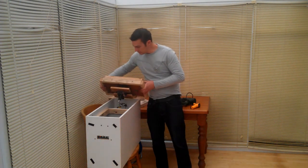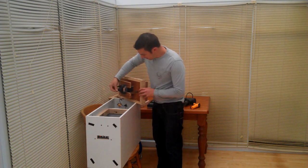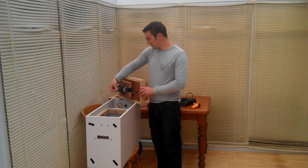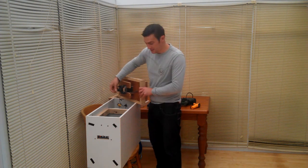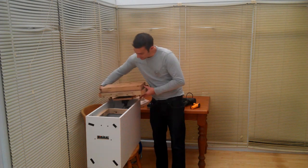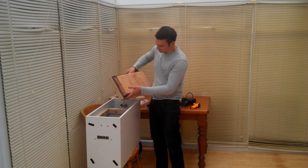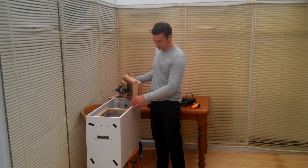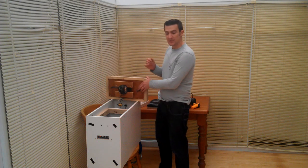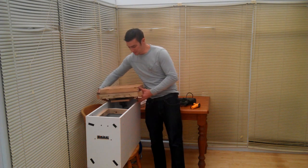My vacuum table itself is all timber construction. This is a vacuum pump out of a Dyson hoover — someone had a damaged Dyson, so I pilfered it, ripped it apart and took the vacuum pump out. I put that into the bottom — it's basically a frame, a piece of timber with lots of holes drilled in it, a box with a frame around the outside and more seal tape on it. At the end of the day, the better seal you get, the better the definition of your vacuum-formed product will be. You don't want to lose any pressure anywhere if you can help it.